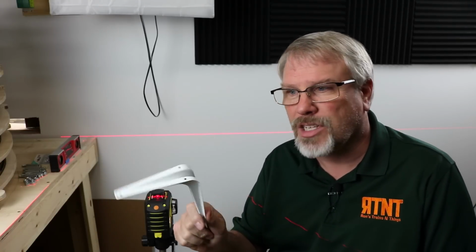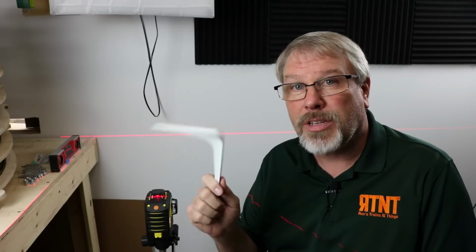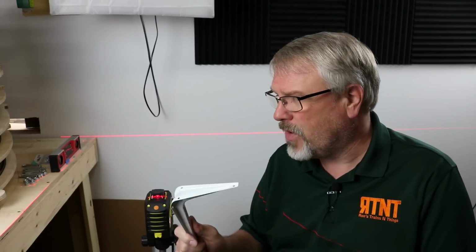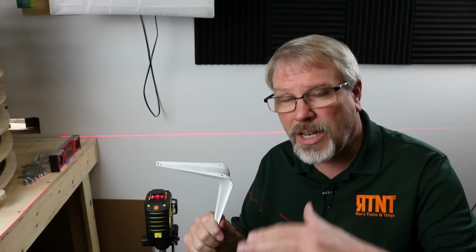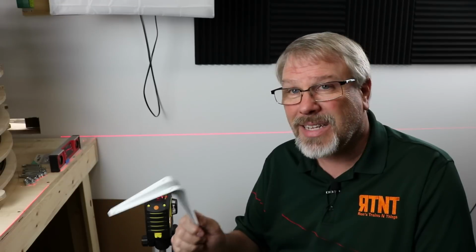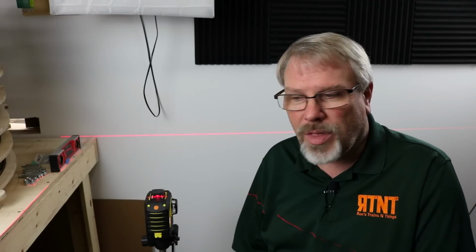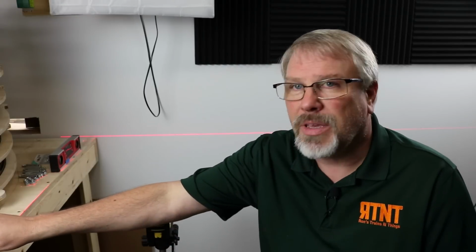So these shelf brackets are going to show, so I got the finished screws for them, and we're going to be doing this in such a way as to hopefully make it look nice in this area as well as be functional. I'm going to be building the bench top here with 1/2-inch plywood, and I've got some nice sanded plywood that I had left over. I actually bought it with this in mind whenever I built the rest of the bench work. And so we're going to be installing that today.